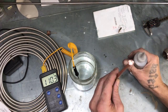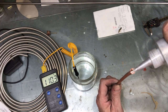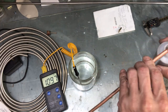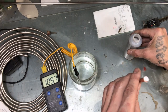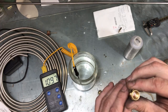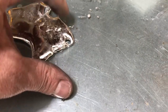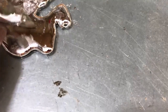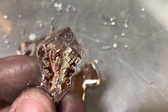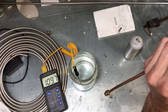It seems to be going in there pretty easily. I don't know how this stuff is going to wet the copper — oh, looks like it froze up there. You've just got to stay above 86 degrees. Another weird thing I learned is that gallium sticks to glass upon solidification, so if you spill some on glass it will stick to it. Okay guys, it happened — this gallium is now stuck. That thing was on there solid, it had a very hard time pulling off. Gallium sticks to glass — that's crazy.